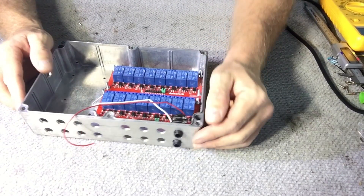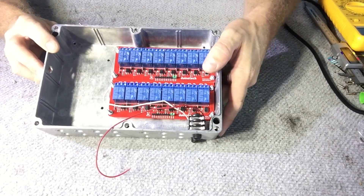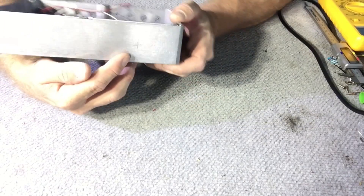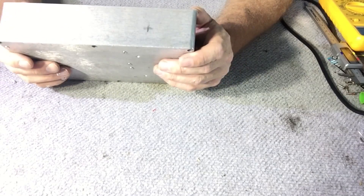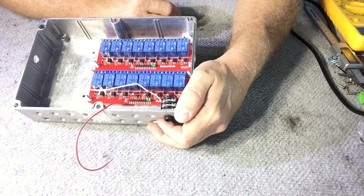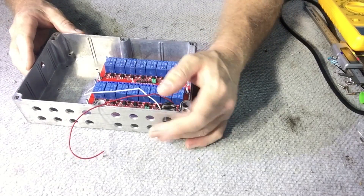Let's check out the main box — the enclosure itself. At the moment I'm just trialling and testing a few things. I have the relays mounted, I've got all the holes drilled at the front, a hole drilled at the side for the output, a hole drilled there for the input. I've got a hole marked for the USB input so I can program it, and I've still got to put a spot in for a power jack. I'll probably have to take these boards back out to mount the rest of the input and output jacks for each loop.